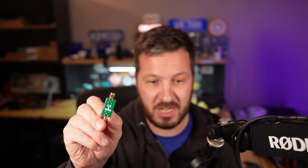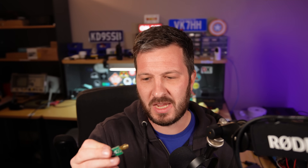I've done some tests on a handheld radio and it makes quite a big difference on receive and also helps notch out those bad spurs from your radio. I'm going to change the design a little to shift the best return loss higher into the 2m band rather than at 142 MHz, and see if I can get it more perfected. This might actually solve the dirty Baofeng issue — let me know in the comments if you're interested.